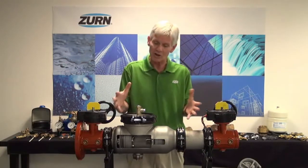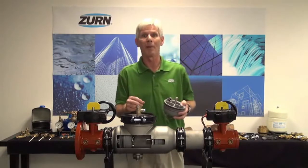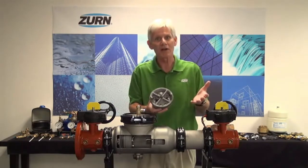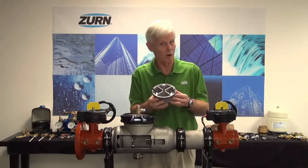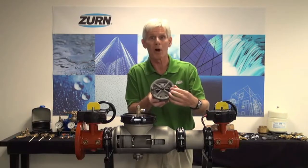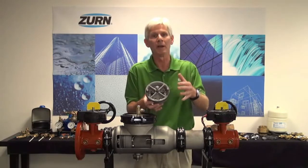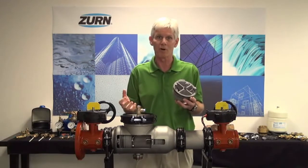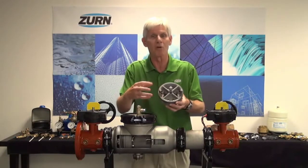Let's talk about some of the technological features and advancements that we've made within the valve itself. I'd really like to start with the compound check. Many of you are familiar with the compound check — we even have a video about how it reduces the head loss characteristic of the valve. It's a tried and true design, but we felt we could make it a little bit better. What we've done is slightly changed the geometry on the ramps that the rollers and moment arms are made up with. By doing that, it effectively lowered the peak on the flow curve when the valve initially opens, making for a much flatter curve. The flatter you can make a backflow curve, the better off you are — we're trying to reduce the head loss in the backflow preventer, and by making those changes in the geometry of those ramps and rollers, we've accomplished that.